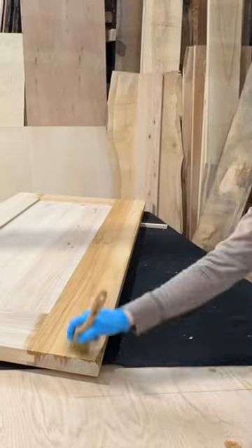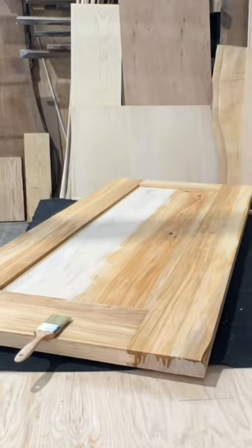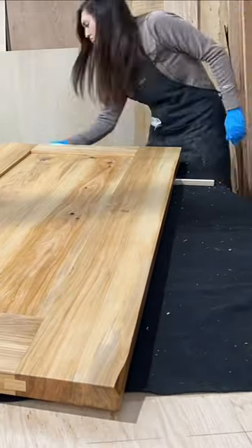It's time for finish. We'll blow all the sawdust off and follow that up with a tack cloth — you really want to make sure there's no remaining sawdust stuck in the wood pores. For the finish, we like using a polymerized tung oil that you can brush on; it's nice and thin to soak in on the first few coats.